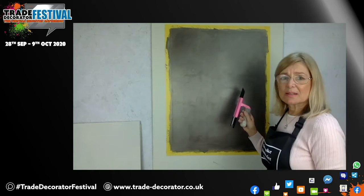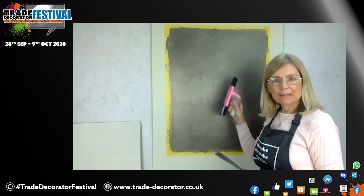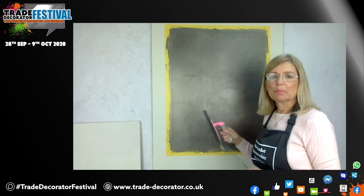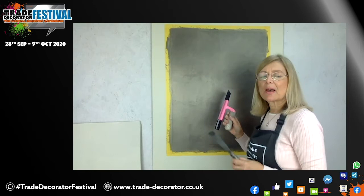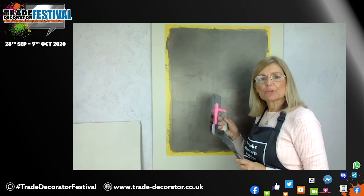And you just work across the wall like that. This is in itself a nice finish — you could just leave it like that, a lot of people like that finish. But we're going to add some more colours in a design just to make it that little bit more custom. The great thing about a finish like this over wallpaper is there are no seams and no repetitive patterns because it's a hand-applied finish. So that's the second coat done, we'll let that dry.